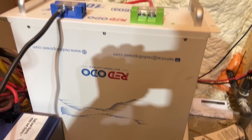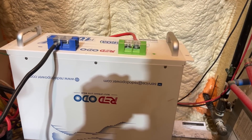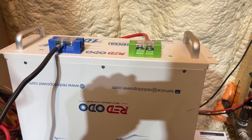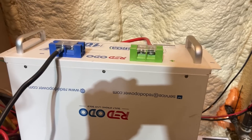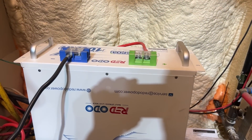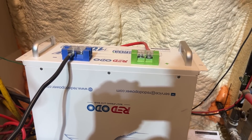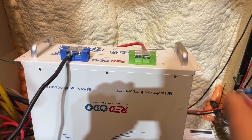It's a smaller, easier case if you put it in a server rack. I don't have a server rack here, so I just have it sitting on the floor. We've been testing it out — this is what I wanted to do in our daughter's bus. Get several of these in there. It's about 5 kilowatt hours of power, and I have that currently tied into a separate inverter here in our solar room. It links into a 6,000 watt inverter, giving enough storage to run refrigerators and similar loads. But for air conditioning and heating, one isn't going to be enough.